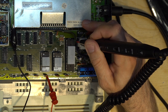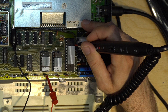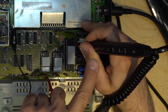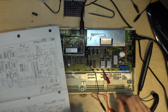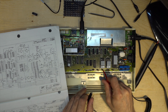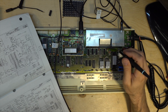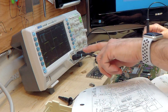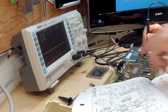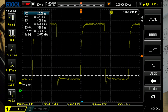Just for the fun of it, let's check pin 37 — 40, 39, 38, 37. Pin 37 now has a good clock signal. That's with the logic probe. Let's try again with the scope and look at the clock signal on CPU pin 37. It is a good signal — square wave, little ripple there but that's not too bad. 5.36 volts.